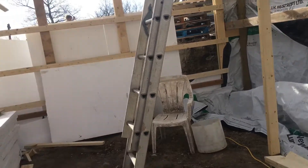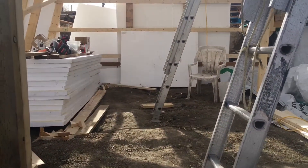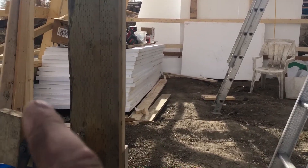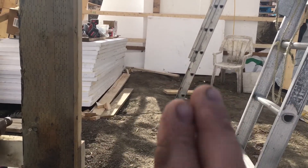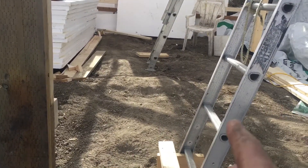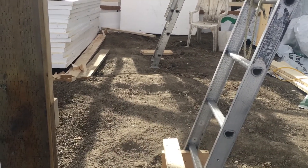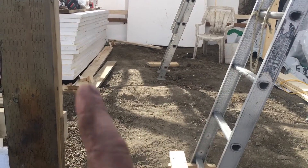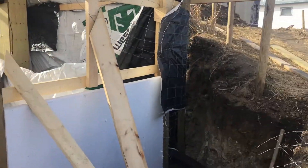When you come into the greenhouse, this is where you'll be walking. We'll have a central walkway down here and then 30-inch beds running the perimeter of the greenhouse. In the middle we'll have 30-inch beds, and the middle walkway is going to be 24 inches to start with, then 32 inches. We're going to have a three-foot-wide spot here by nine feet basically for kids to play in the wintertime, and then 18-inch walkways going off there. Tomorrow we finish the purlins and then get going on this end wall.